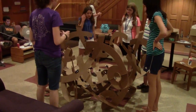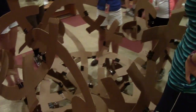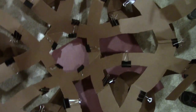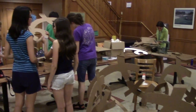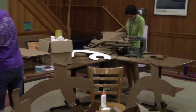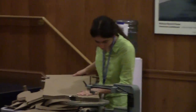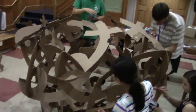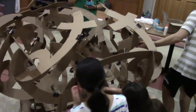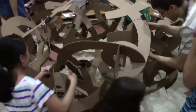When you've seen the pattern of what connects to what, you can then add another five modules. Clamp first, and when you're sure everything is correct, unclamp one joint at a time to brush on a thin layer of glue. The clamps can stay in place for a while while the glue dries. While some people are assembling, others are working at the same time on cutting more pieces. I encourage people to swap roles occasionally so everyone gets some experience on each aspect of the process. Once you understand the pattern, it's a nice puzzle to figure out where new modules go.